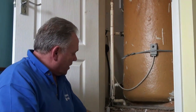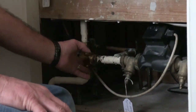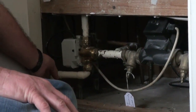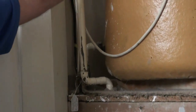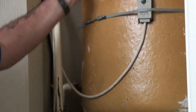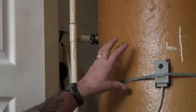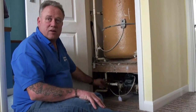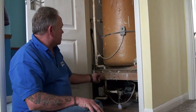So let's go back down to this diverter valve. When the water gets here and asks the valve where to go, this valve has the option of sending it down to the radiators, sending it up through this pipe to the ninth radiator — the copper coil in this indirect cylinder — to heat the coil, the water in the coil, and/or the water in the radiators. So it can send it one way or the other, or both.